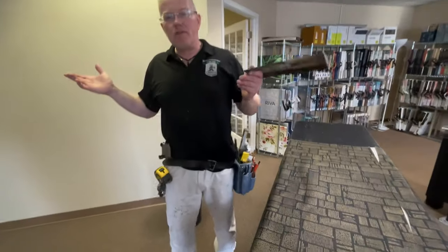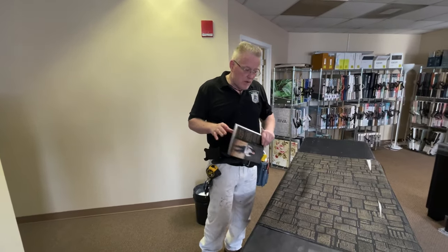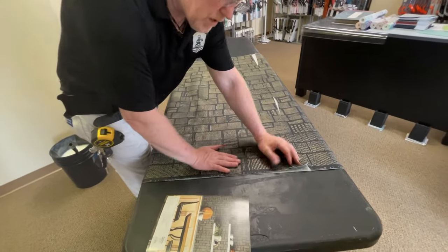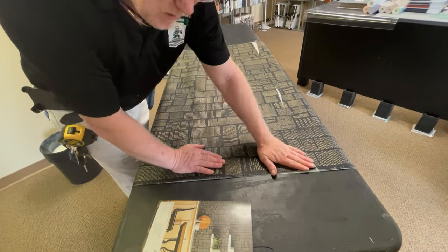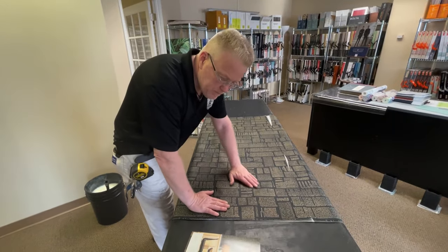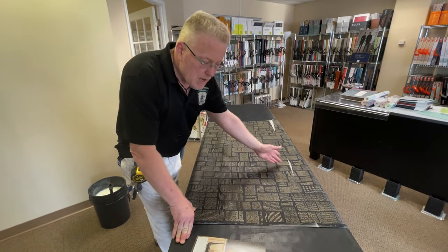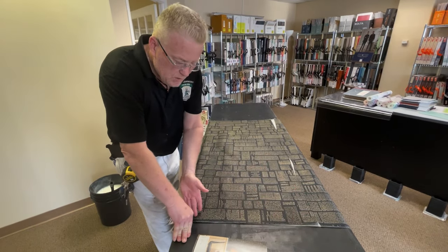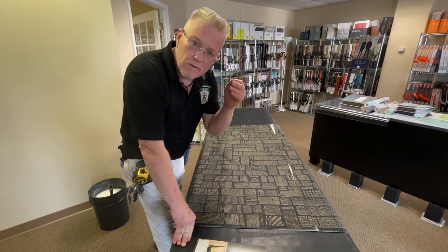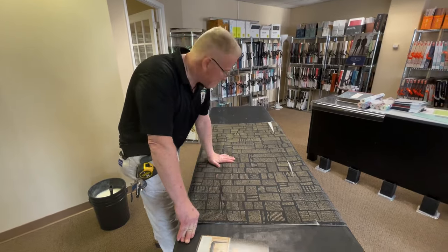I'm gonna put it up in the entrance to the office. It's gonna look gorgeous. A couple of things you wanna know when you're hanging this. You wanna have a heat gun available in case you need to bend the wall covering back into place. Secondly, we know commercial vinyl gets double cut. And so the instructions, always reading the instructions, indicate that 1.5 inches overlap, and then you cut through that bleed. When you overlap, it's called bleed. The part that remains is called live. So let's get to it.